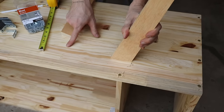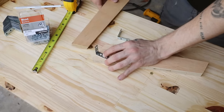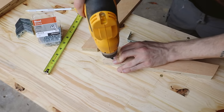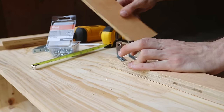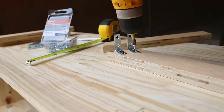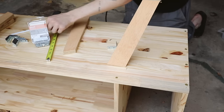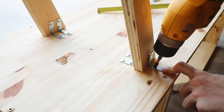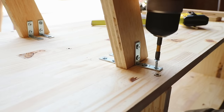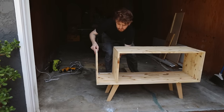Now it's really nice actually having this paneled wood because it kind of acts as a line for you. So you know exactly where to put your legs. So I just followed the paneling on the wood and just made sure that they were all in the right place. And I did use 2 brackets on the front side and back side of each leg. And I just made sure to set the front leg back far enough to where the only way you'd see it is if you're really underneath it and up close to it, you know? But it really did need this structure and durability. So I wanted to make sure to add 2 brackets to each side